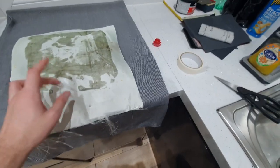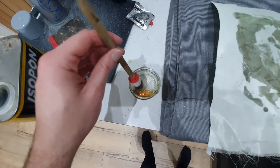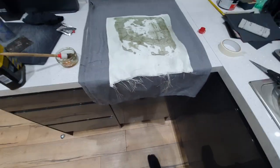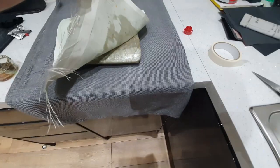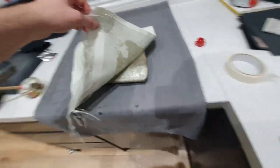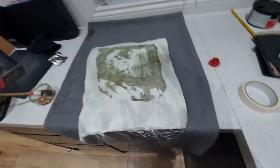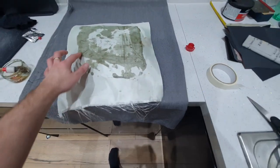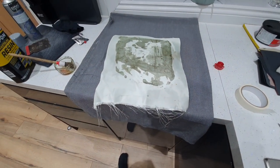I've laid the first layer of resin down and set the second sheet on top of it. Hopefully that goes hard over the next wee while — you can already see it starting to go that gloopy way. I'll leave it to sit and come back in 10 to 15 minutes. The first layer is definitely looking fine; there's a couple of wee bubbles on the side and a wave right where my finger is, but that's not too bad. I've got the other stuff to reinforce it from the back side — this is so you're not having to sand too much on the face.